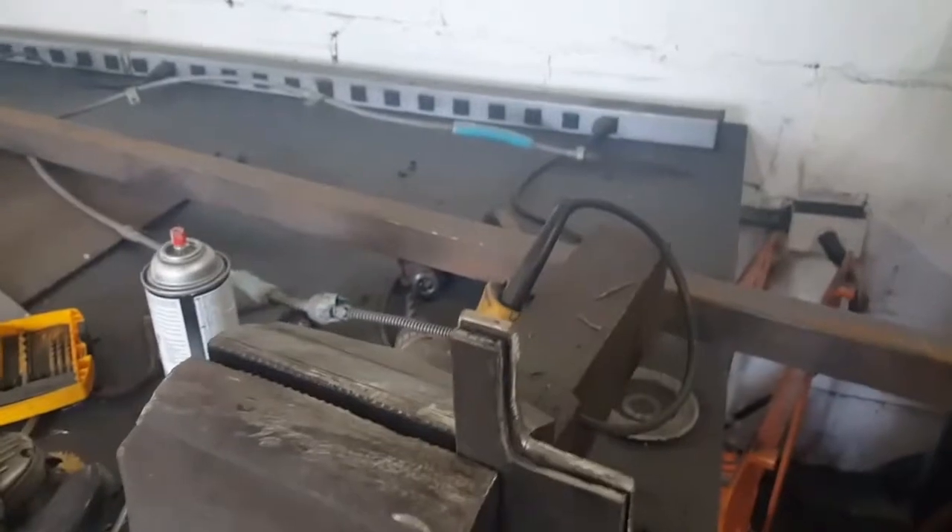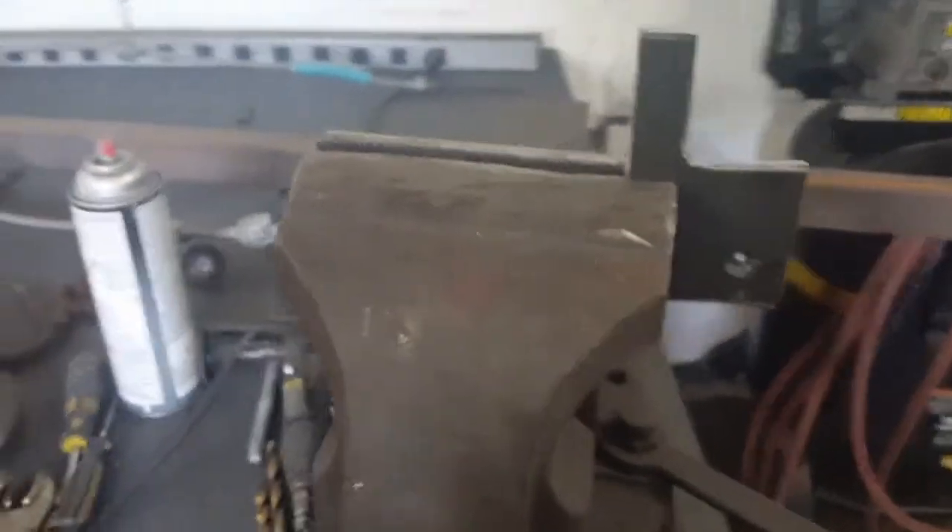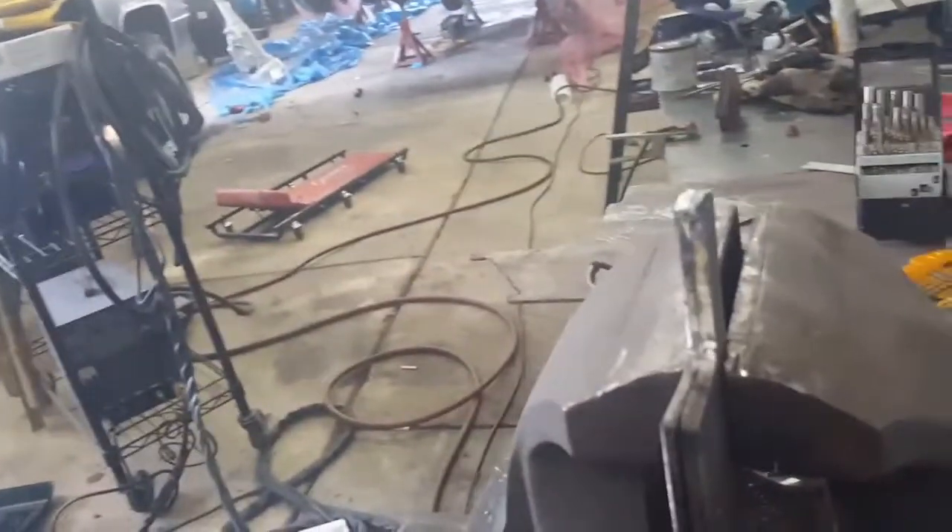Because in this kind of fitment, if it's a little bit smaller that's okay. After about four minutes of grinding, we have two identical pieces. I already went ahead and made my pilot hole for the mounting hole. It's not the hardest thing to do — people have been cutting steel for years, there are just some faster and better ways. My ways aren't perfect, but they work for me and the tools I have. One other thing: when you plasma cut steel, you're actually changing the temper and hardness of the steel. When you go to grind, make sure you have hearing protection and eye protection, because it's going to throw sparks everywhere.